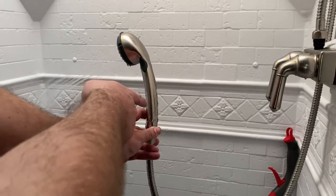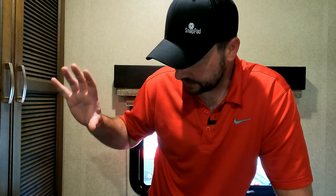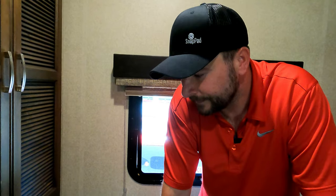One thing that really confused me is after those things happened, I thought I should probably check the water heater. That is placed underneath the wardrobe in the bedroom. So I took all the drawers out and had a look down there and it was wet. I was very concerned. We turned the water back on and I could not find where the water leak was coming from. After a whole bunch of experimenting, I thought it was maybe coming from the back of the shower, which backs onto this wardrobe. I figured maybe it was the shower pipes going up into the shower.